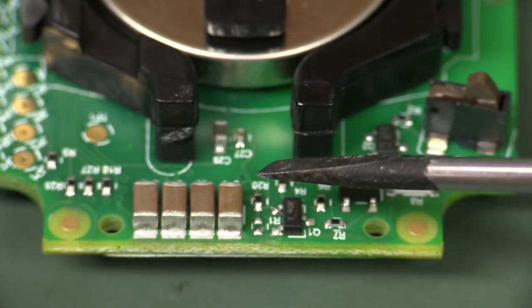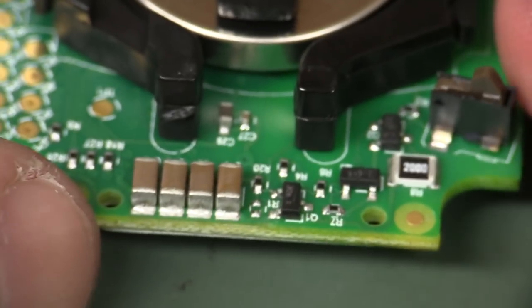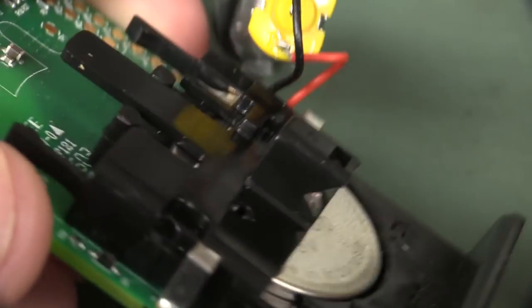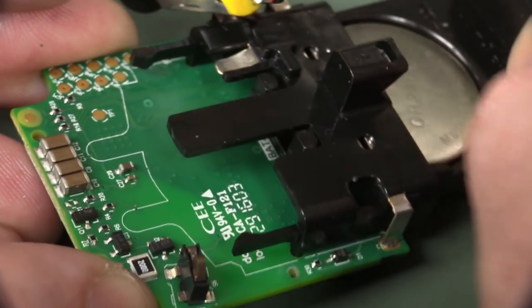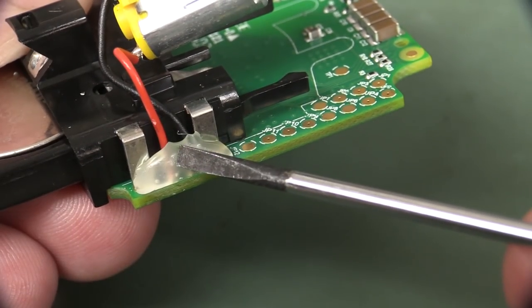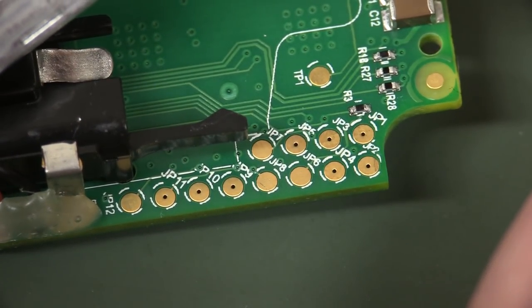On the top side we've got a little bit of power reserve and bulk capacitance, just to handle the transmit bursting. That also helps when you're fiddling with that external battery on the contacts — you don't want a little wiggle to accidentally release it for a millisecond. You want the bulk capacitance there to just keep that charge. They've developed this custom plastic holder solution with the external contacts and everything. That's really well designed — they put quite a lot of thought into that. There are also contacts for a bed-of-nails tester for production, and that would be the programming port for the micro and the Bluetooth chipset as well.